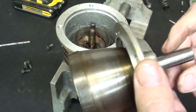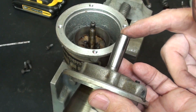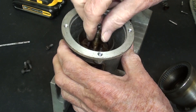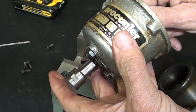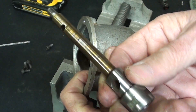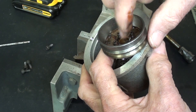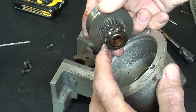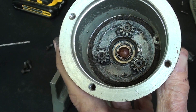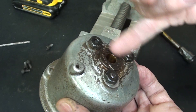Notice that the input shaft going into the drill press chuck is not continuous — it does not go all the way through; it is totally separate from the shaft that actually drives the tap. Now the shaft can easily be taken out — a hardened and ground shaft. There's that cross hole, and that allows this other part, this other cone, along with the sun gear, another bearing, another bronze bushing. You can see yet another bushing down there, and there are the planetary gears held in place by those bolts — I'm not going to take them out.